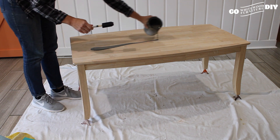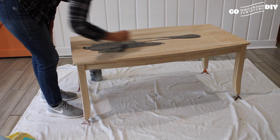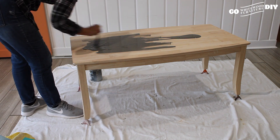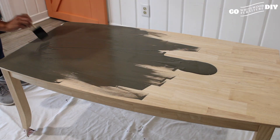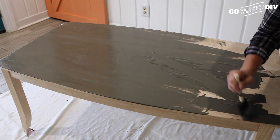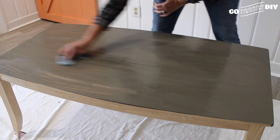This is a beautiful stain. What we love about staining furniture versus painting furniture is the stain actually is absorbed into the wood and you have a lot of control over the end result. If you want the wood grain to show through, you're going to do a thinner layer and wipe it into the wood so you can actually see the grain. If you want it to look more refined and modern, then you put it on a little heavier and don't wipe it off so you're not necessarily seeing a lot of the wood grain.